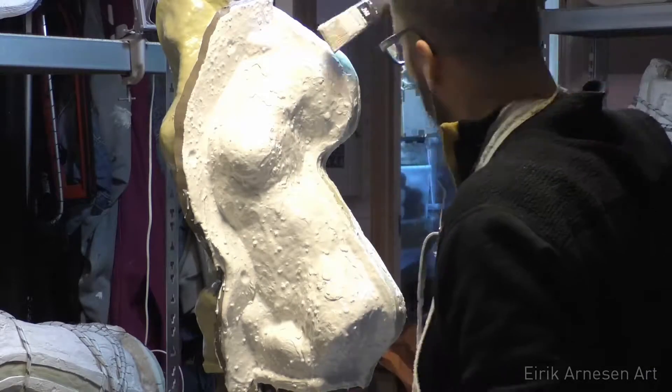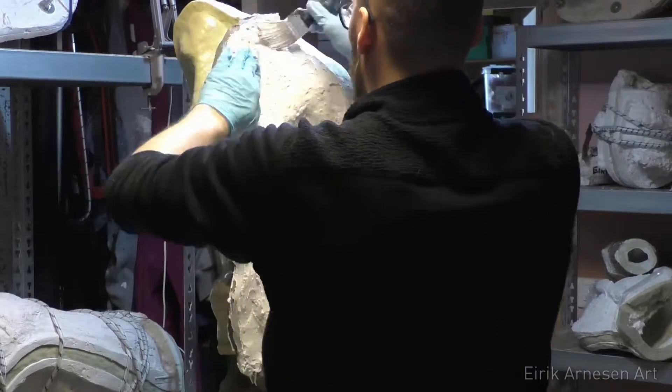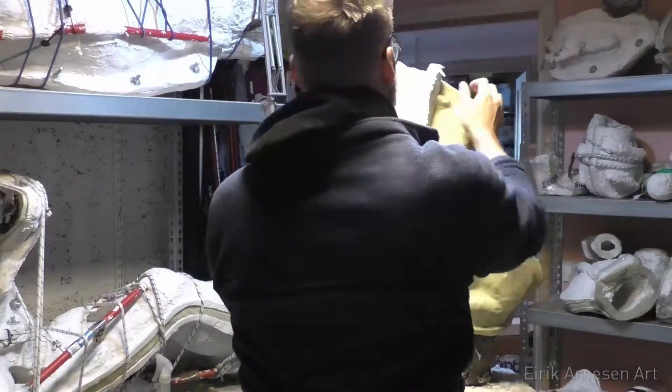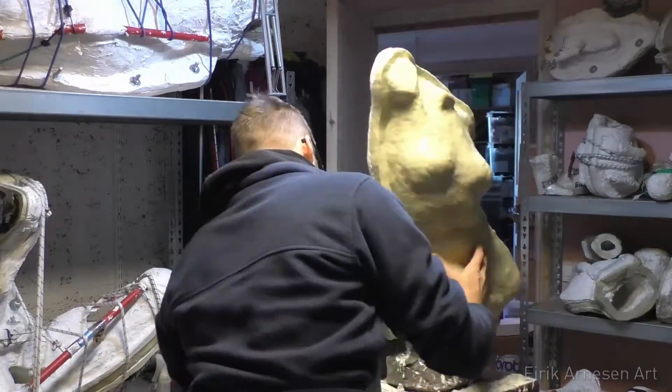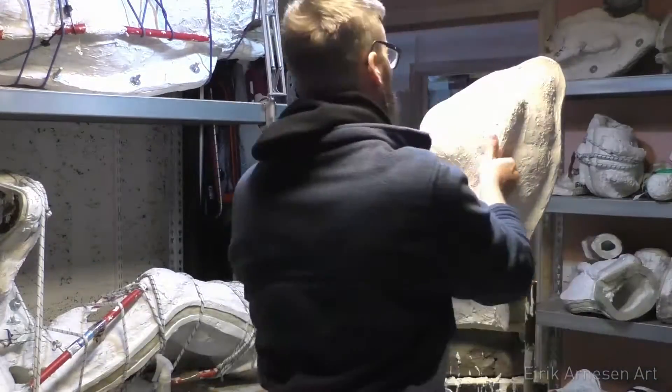You can see the splash coat here running down a little bit, which gives you an idea of the consistency I use. Then we tamp in some fiberglass again — it's pretty much rinse and repeat. As you can see, these two front pieces came off real nice and easy, and the back came off pretty easy also, though a little more work than I wanted.